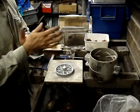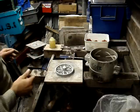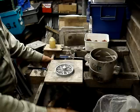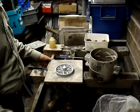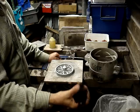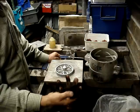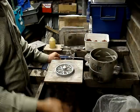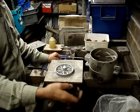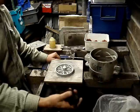Welcome to my molding shop. This is the back of my shed. We've got a molding bench here, a good solid bench, and a trough or tray made out of a bit of old wood. This holds the sand — the green sand molding we're going to do today. This is a clay-bearing sand coming from Mansfield, a North East Midlands town — Mansfield Red.